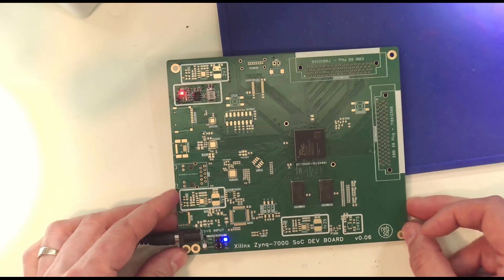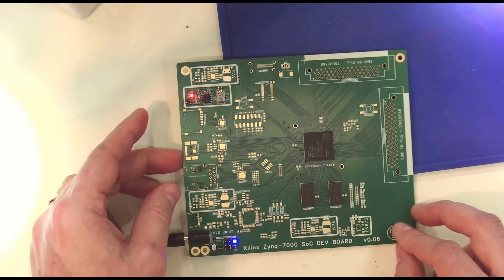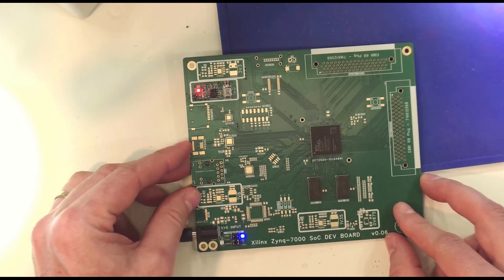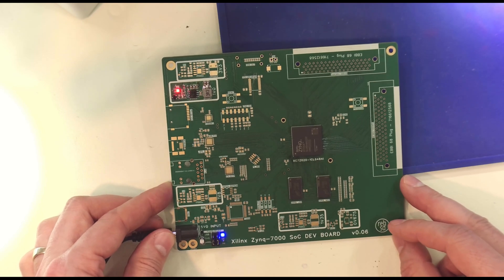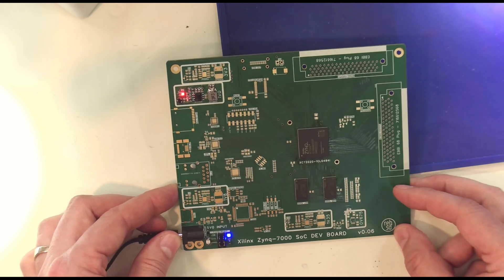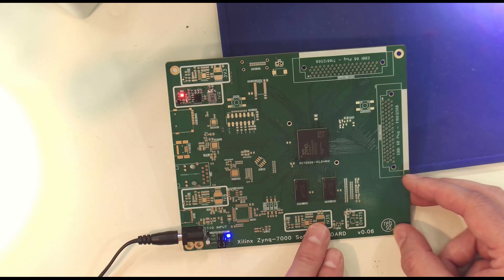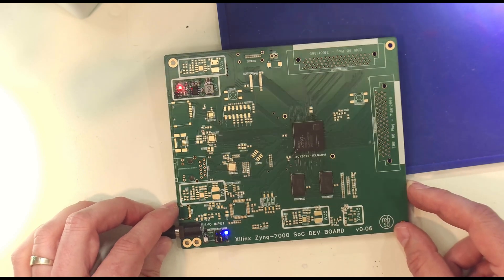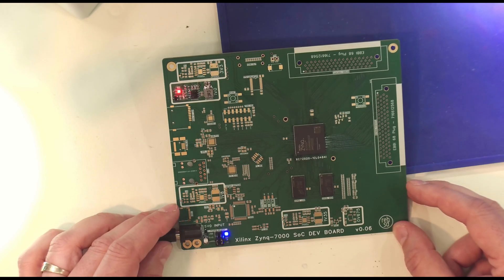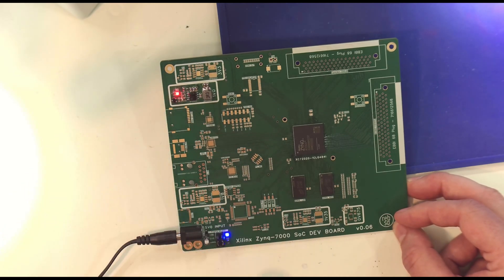That gives me confidence that the power setup is working for the 1.0V. I've got my 5V and 1.0V done and now I just need to continue the process with the remaining rails. I'm going to stop here for now. In the next video I'll come back with the rest of the rail components populated — that will just take some time to hand solder. If one of the rails isn't outputting the expected voltage I'll come back sooner, otherwise I'll get them all up and running and figure out what to populate next.